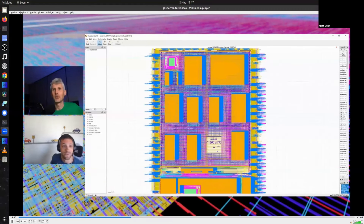Good news: all the AES cores seem to work. We have a tool called Inspector that generates plaintext, sends it to the management core via UART, which sends it to the AES core for encryption. The encrypted result goes back through the management core to Inspector. Simultaneously, we're taking electromagnetic measurements, looking at the EM field over a particular point in the design — which requires getting the probe very close to the chip.